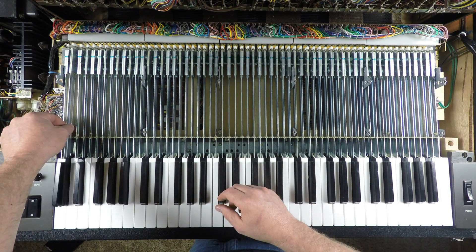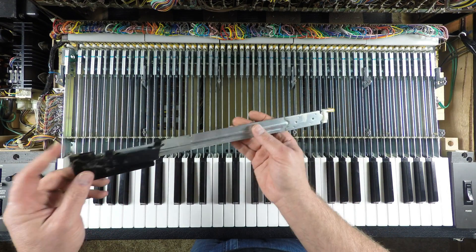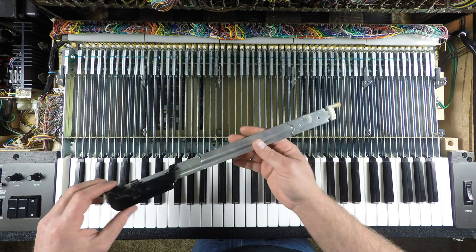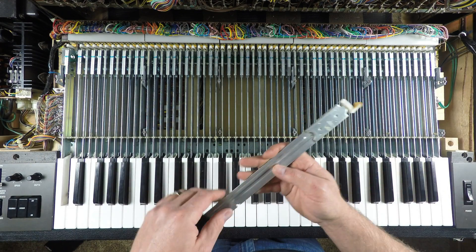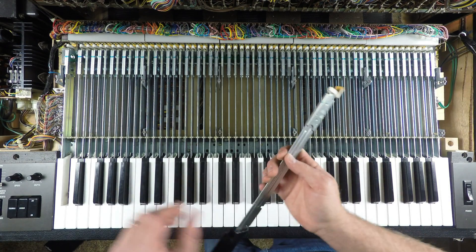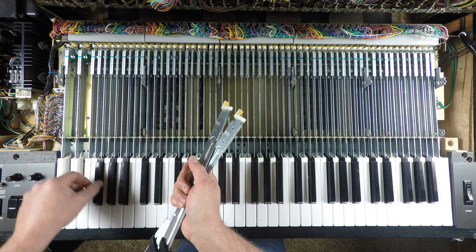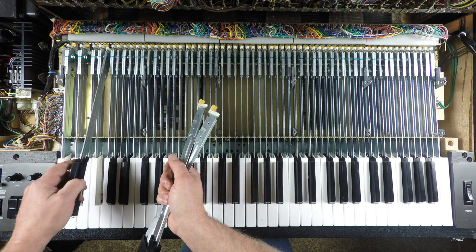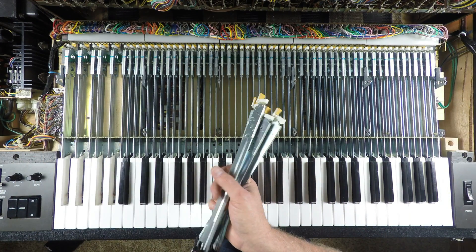Just a piece of felt. Now the black keys just lift out — pretty dirty. They are weighted, and they are all the same, so there's no order; they don't have to go back where they came from. They're a universal part. Just be careful when you lift them out — lift from the front so they aren't lifting up on the little lever switches in the back.